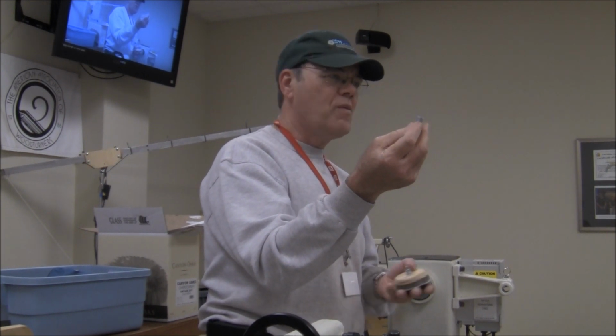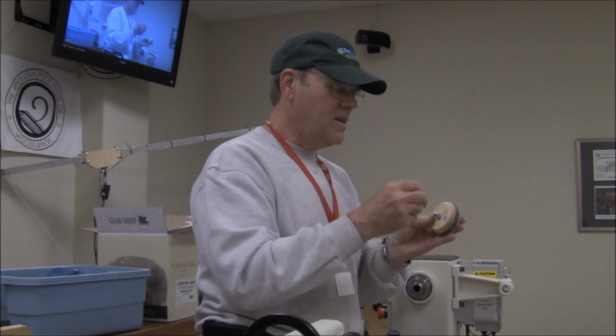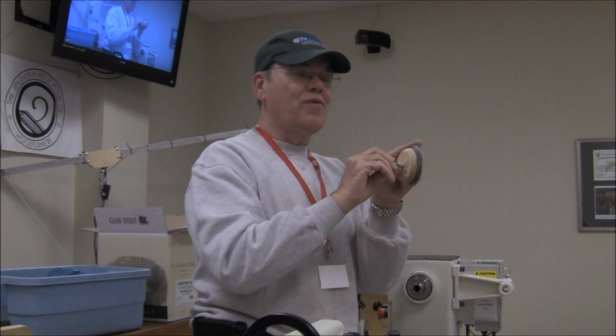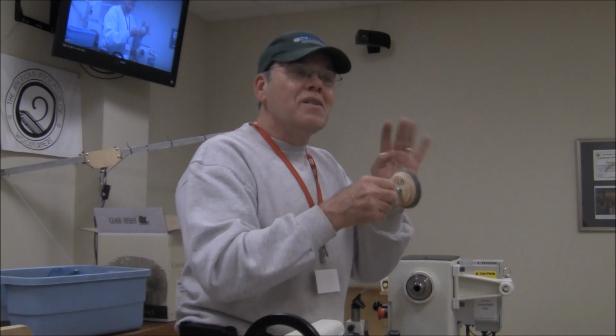Coupling nut. You get 4 of them for a couple of bucks. Don't make this thing stick out much more than a 1/4 inch, because it only takes a few threads to hold it. More than that, and you're just doing more threading.